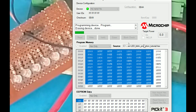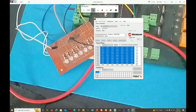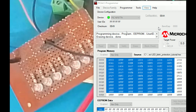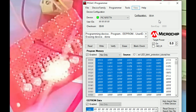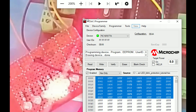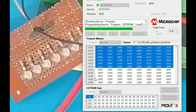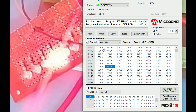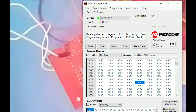This code is password read protected. Once I try to read it, I will not be able to read it — that is what it should do. We burned it and written it. Now I power it up using the PICkit 3. We can see the code and the LED is blinking. This is fine. Now I try to read it — I click on read. Because read protection is applied, we must not be able to read it. See, 000 — that is what read protection is.